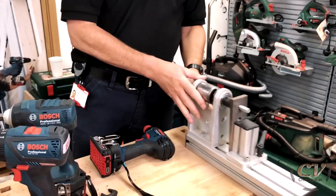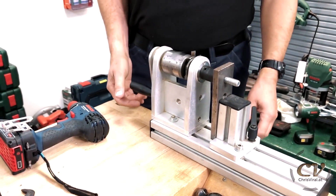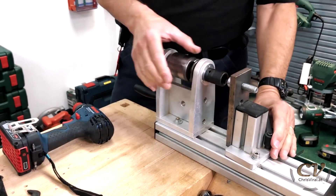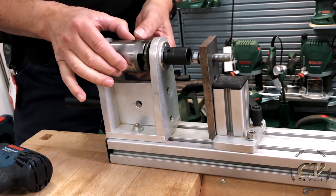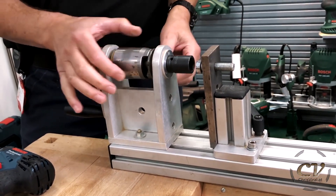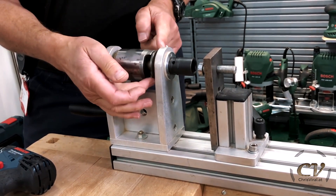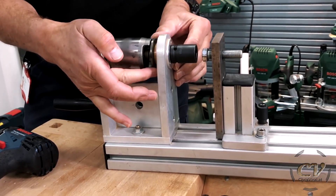This is a larger mechanism from an impact wrench, but it's just for illustration purposes to show you how it works. We've got this set up with a socket on the end. Inside is a very simple mechanism — it's a striker. This heavy weight here is a striker, and attached to the striker or influenced by the striker is a smaller part here, which we call the anvil.